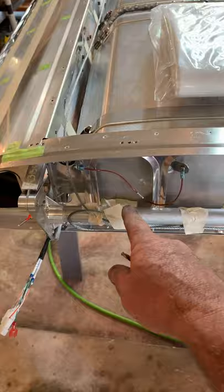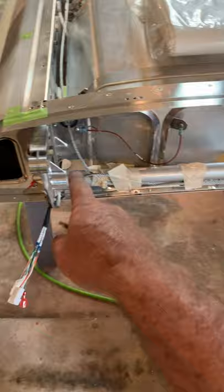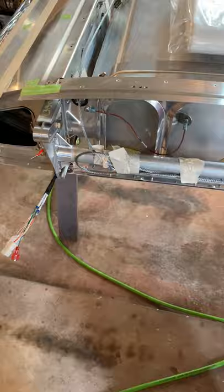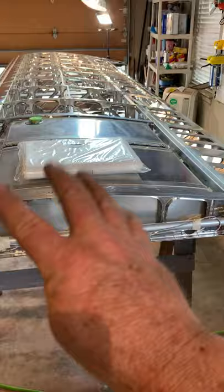Down at the end here the ground wires are installed. This is the right wing, so the cable end is long - it will eventually come across over the top of the fuselage and into the left wing, connecting in the fuel bay of the left wing with shackles. Just take those up out of the way. Everything was blown out very well - I take a leaf blower first since it has a wider pattern, then come back with a fine-tip compressor blower.